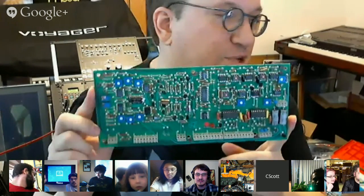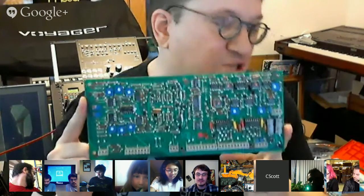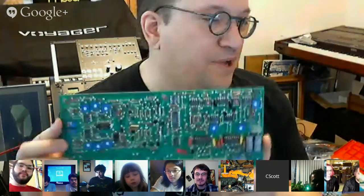This is a vintage OBX voice card. And it is all discrete except for one section, and I'll get to that in a moment. But Oberheim had to use the parts available of the day. There's lots of 741s on here, and lots of mica capacitors and what have you. He doesn't have the nice polypropylene and whatnot available today.